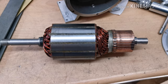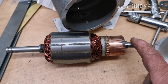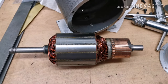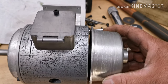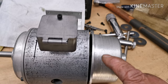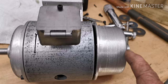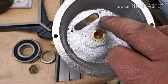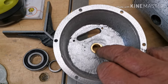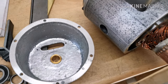That's both ends of the shaft turned down to size. I'm going to try it into the body and see if it's fitting. As you can see there's a little gap there, but I have allowed to turn the inside of these down a little bit more, especially this one. When I machined the outside of these I thought I might have to clean the insides a bit more, so I left those to do for fitting the rotor — that'll be what I'll be doing next.